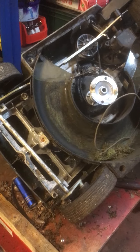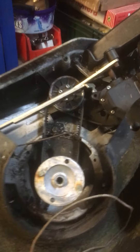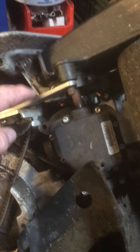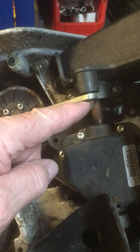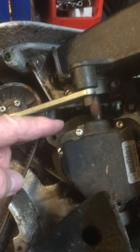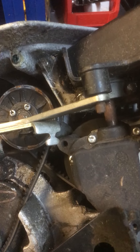They don't use two screws — they use ten. Anyway, I had a good look and found the root cause, and here it is. I've just put this back on, but this shaft here — there's supposed to be a clip. The clip has failed and this shaft has come off and floats about. I'll put it back on and I'm about to put a clip in, just to put it back where it should be.